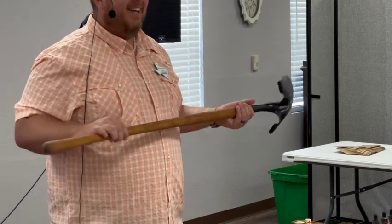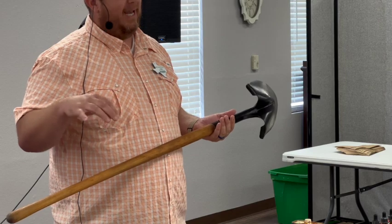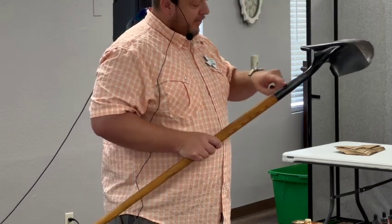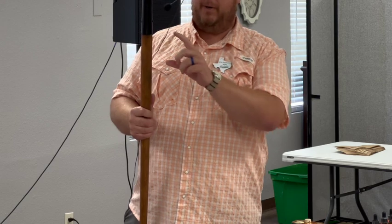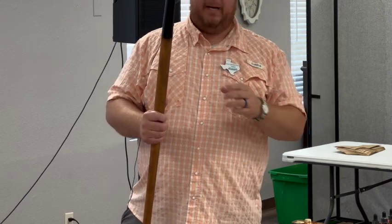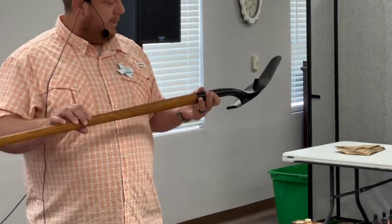So if you're rehabbing the handle — the wood part that's inside the metal — do you have to take the whole thing apart? If you feel like it's going to crack and you really need to get in there — some of this is exposed here and you can 100% just pour oil down in there until it won't take anymore. But right through here you're not going to get there. These like this are not a casual job: you'd have to grind this off, knock the pin out, then re-brad a new pin in there — just hammering over an anvil. I bought a pin on Amazon and put the new pin back in. I took the whole thing out and got all of it soaked in oil when I did the restore on this one.